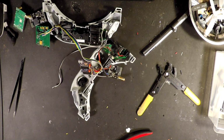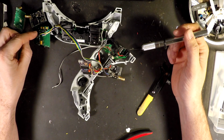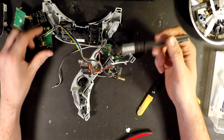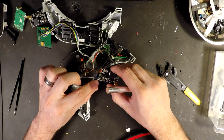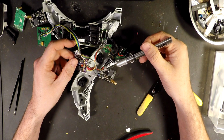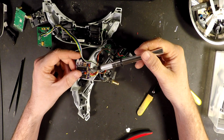All right, guys. Figured I'd take a quick stop right here, just to make sure everybody's still on the same page. All I've done so far is, we already had our small ribbon cable connected to our channels, running across. The blue, green, and purple lines went into CS1, 2, and 3 on our secondary receiver. I got a cable from our RSSI port and our video going into video 2 and RSSI 2.